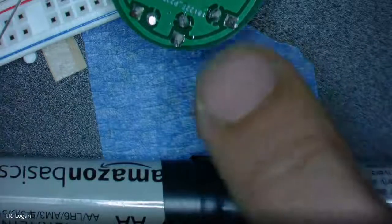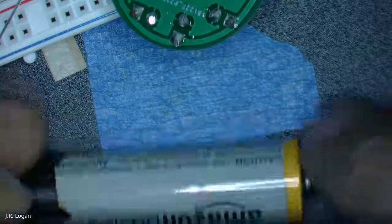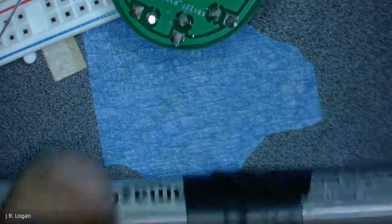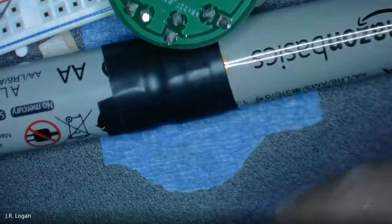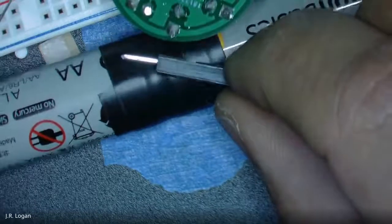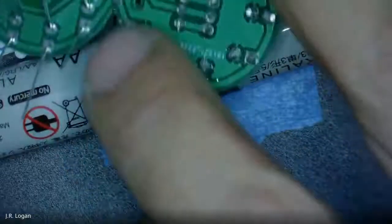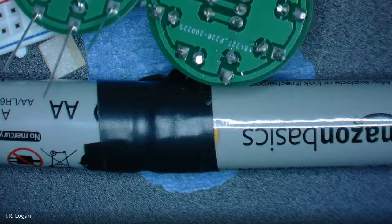And we know that this is calling for a minimum of 4 volts. So you want to tape together 3 different batteries end to end. And then what I did is I taped the metal component just so they'd hold in place. And then I had to hold my finger, kind of sandwiching the whole contraption so that all of the conductors were touching each other, and these were touching the end. And I was able to get my heart to light up. So obviously a nicer little battery compartment is preferred, but this will do in a pinch.